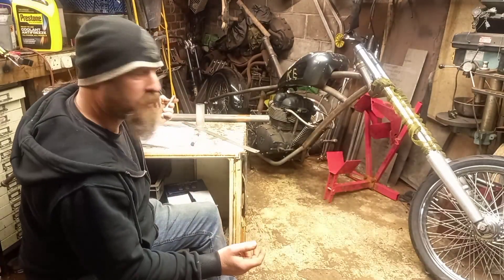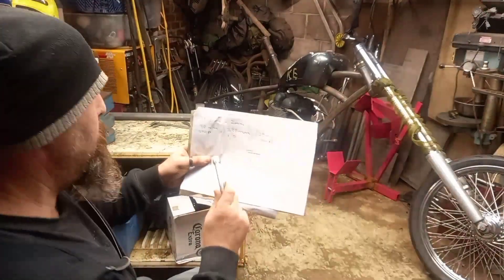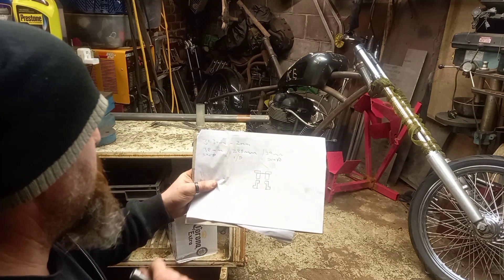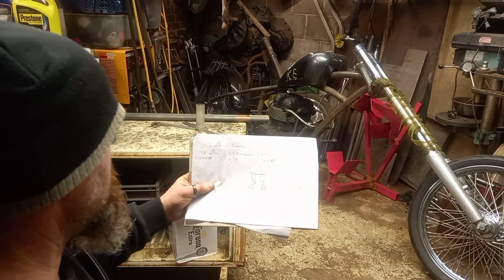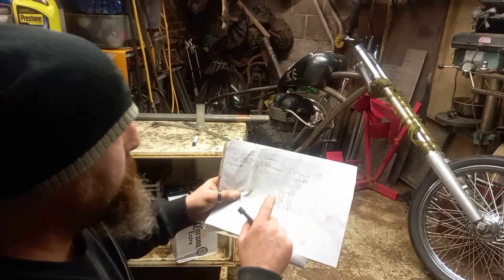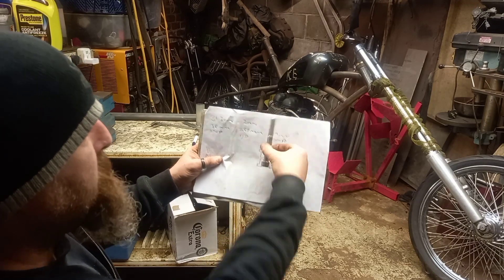I call it tie style because that's where I first saw it. I've made this little drawing of what I want the collar to look like. Took some measurements off the bars: 31.3mm is the distance across the top. 38mm is the overall diameter I want it to be. That needs to then step down to 28.8mm, probably 28.7mm for a bit of clearance, and then the total depth of 20mm. Basically I want a pair of collars that go top and bottom of the yoke, and the bolt fits in the middle.